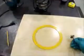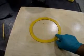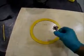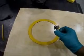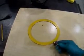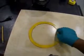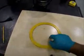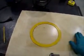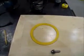So I need to machine the ID of this ring to 7.5 inches, or I should say 7 inches, because I've got a 1/4 inch rabbeting bit. The base plate's 7.5, so 1/4 inch each side is half minus 7.5, 7 inches. So I have to machine this to 7 inches, and then I can screw this to the bottom here and use a flush trim bit and go around, and that'll cut the inner part of my circle. So that's my plan. I'm going to go get that in the lathe and machine the ID of that ring.